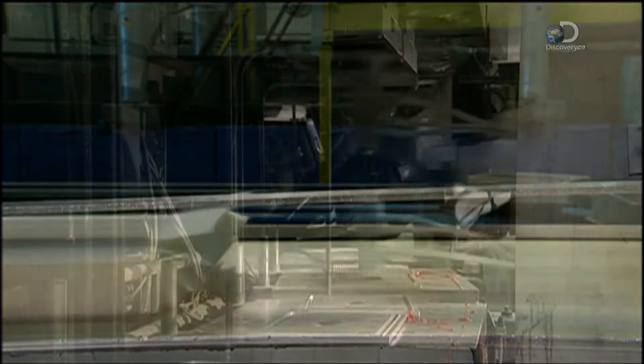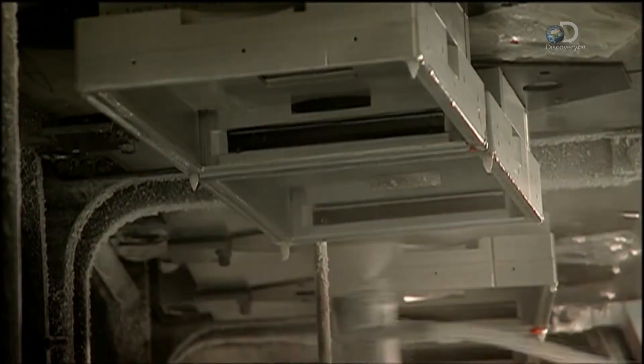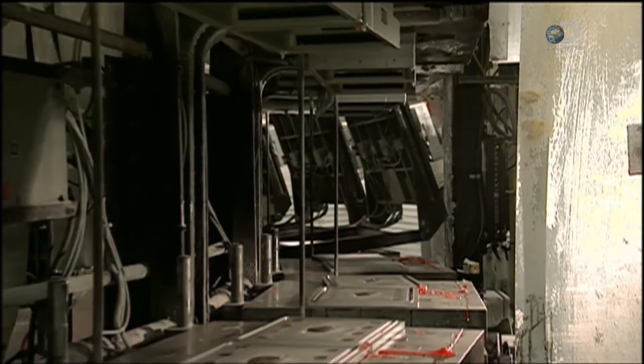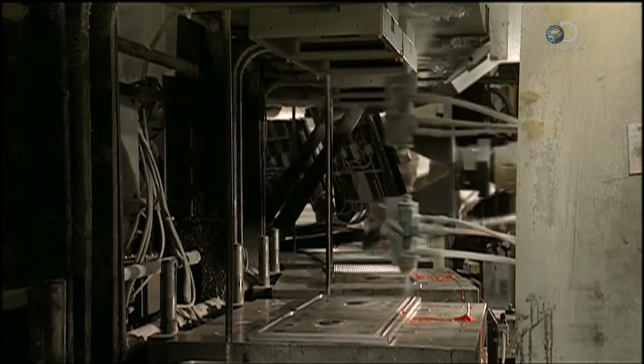In the meantime, a robotic arm sprays liquid wax onto aluminium moulds that will shape the tops and bottoms of the filters. The carousel turns, positioning another set for spraying. The wax ensures that nothing sticks to the moulds during the next steps.